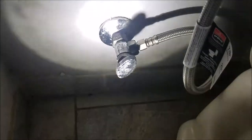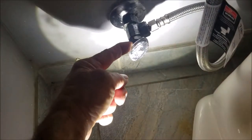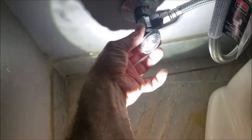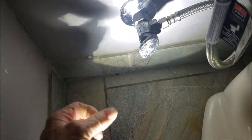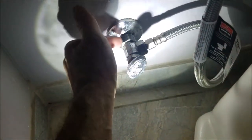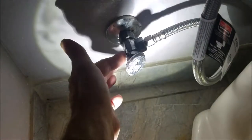I would monitor it. This valve — when we shut it off, as we explained to the homeowner, whenever you start to mess with these at 20–30 years and nothing's wrong until you go to turn them off and on, then it starts dripping out of the packing nut. So this started leaking right away. We did tighten it down and right now there's no moisture back there. But do monitor these, because if anything develops you want to shut off the water. If it becomes excessive, we'll need to come in and replace this valve. It looks like you've got copper stubbed out — it's a compression angle stop. So we put a new quarter-turn on/off valve on here, reconnected this, eliminated the adapter, and tied it back into the toilet.